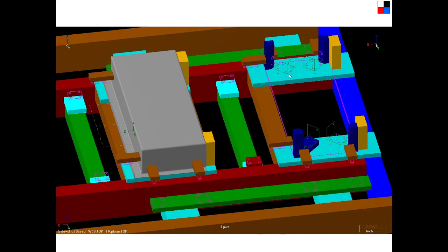Well, what is he doing with this? It turns out what he's doing is he is putting a heat sink and a clamp on the inside of each corner. So on this part, because it's a grease reservoir, it's really important that the weld be good all the way top to bottom so that it doesn't leak any grease out. And for whatever reason, in the process, he felt that this weld needed to have heat pulled out of it while the weld was occurring, and also it needed to be pushed from the inside as well as the outside to make sure that the pieces were where he wanted them to be.